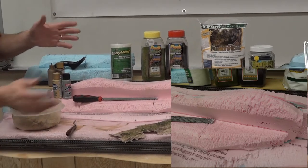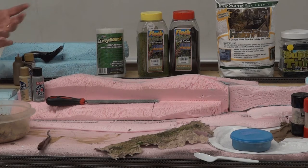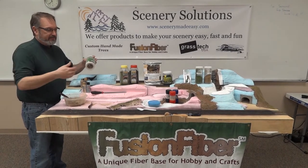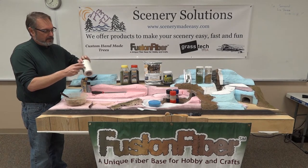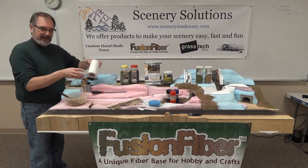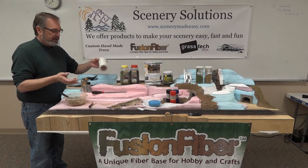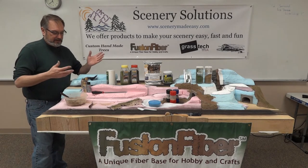In my shop I have vacuum hoses — I just hold the vacuum hose in one hand and rasp with the other, and it's nice and clean, doesn't make a big mess. On the foam board, just make sure you rough that up a little bit. One other thing you can do if you've got a big flat area: the fiber tape that you get for drywall comes in many different sizes. It has a sticky side so you can put it right over the foam board and that gives you enough texture to grab your Fusion Fiber without using too much.